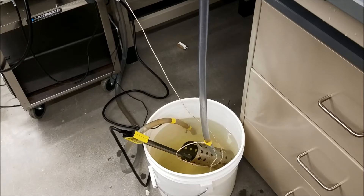Water is kept in the hot reservoir and its temperature is maintained in the range of plus or minus 0.2 degrees Celsius of the specified temperature. An immersion water heater is used to heat the water. A thermostat-based heating controller is used to keep the water temperature at the desired level.